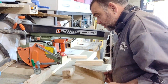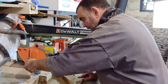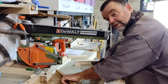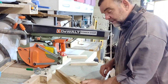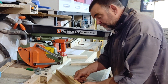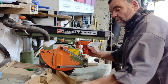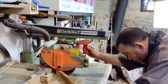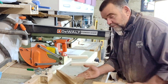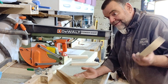All I do is put the jig on there like so, put my little clamp down, make sure it's in line with the blade, and that holds it down into place. Then I place one bit of wood along the fence, and I know that the edge of this board is in line with the blade. If you tap it along — that's perfect. If I bring it to the end of this face here, I know it'll be exactly where the cut is going to be. So it's very simple.